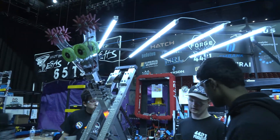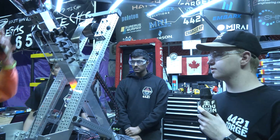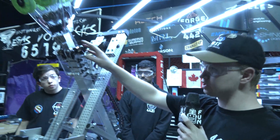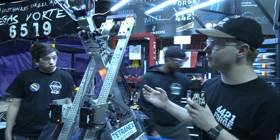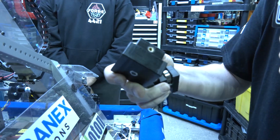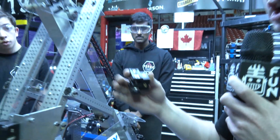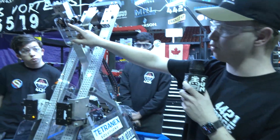Moving on to Nathan — can you tell me about the winch process and the internal system? Sanjay mentioned the wiring going through the telescope on top of the telescope. We're using the Thrifty Bot telescoping tube, but immediately ran into a problem with the stock down-blocks. They're a beautiful machining job, but designed for upward linear motion instead of outward. We ran into a ton of friction, so I designed a replacement block that uses bearings. When we're at an angle, we no longer have binding in the tube, and combined with the third spring Sanjay mentioned, it allows really smooth motion.